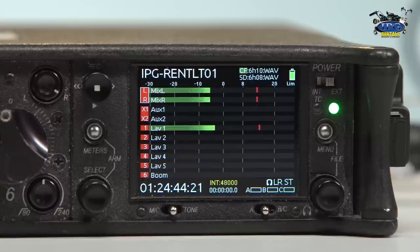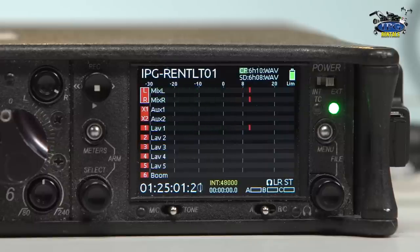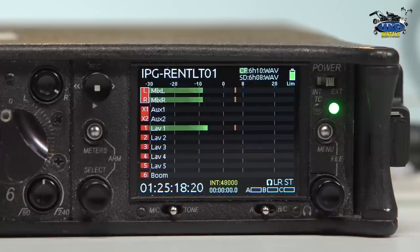On the top right, you're going to see the internal and external switch — that just means what power source you're using. Internal you have to have 5 AA batteries; external is some sort of external battery source, which we use the BDS system. Underneath that, you're going to see there's a timecode LED light that's not lit up right now. What that indicates is that it's still running timecode even when the mixer is off. You have to have a battery hooked up, either the internal batteries or another system it can pull power from, because if you don't, it will lose its timecode. So you may have synced up your timecode to cameras and they're still running, but if you turn this off and there's no other power or battery source, it will lose its place in timecode — and that could cause a lot of problems during production and in post-production.